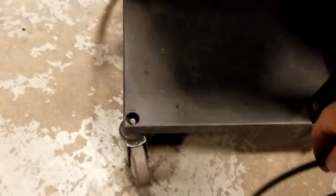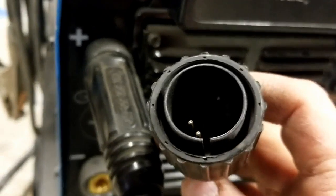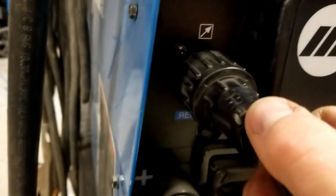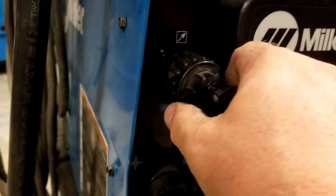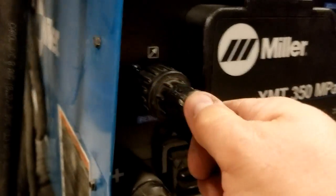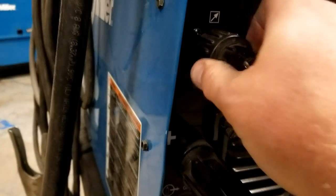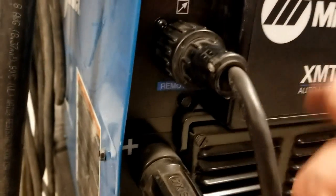The control cable is a really light-duty plug. Once it's pushed into the socket it's plugged in — it does not have to be tightened down, but we don't want it falling out. There's an alignment pin at the top and a slot, so those have to line up. Don't push hard — give it a little wiggle and turn only the outside of the basket. It's not necessary to make it any tighter; locking it down tight has nothing to do with the electrical connections on the inside. Never rotate the inner part — it will just twist the wires off from the cable.